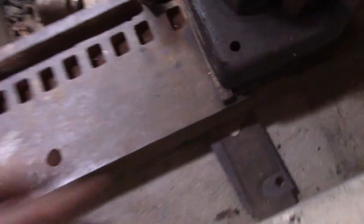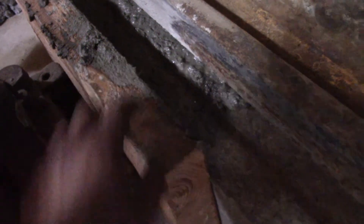So now we have to put shims in over there, get this bolted down the way it wants to be, and grout in over there and then all around the engine. The jacking holes in the foundation — we blocked these off and filled them in with concrete. Now we will just fill in with grout this area here between the foundation and the engine.